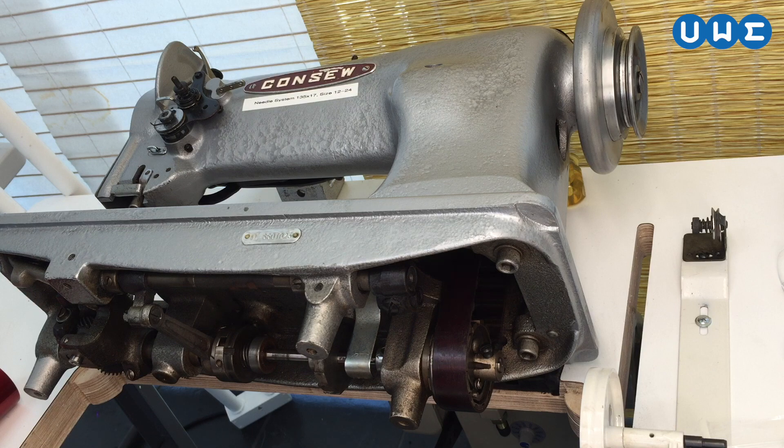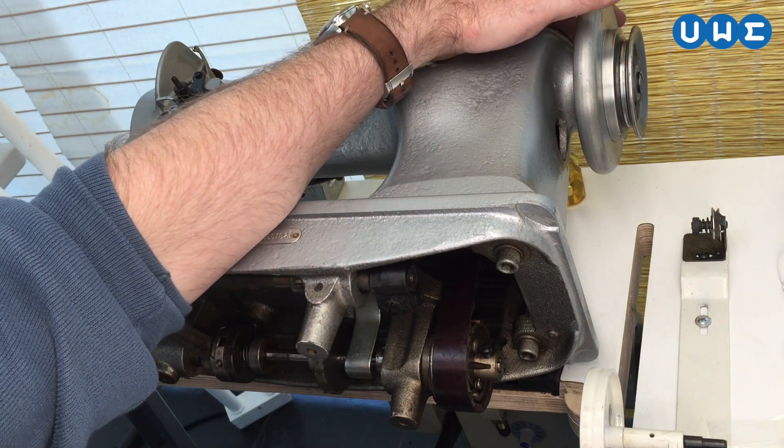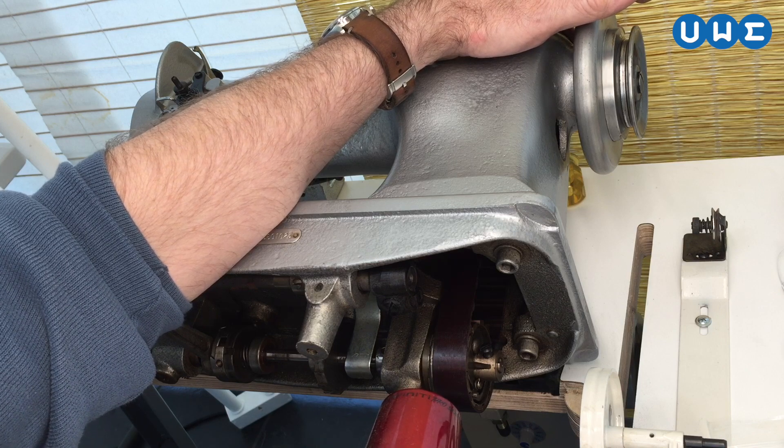In case they're off for some reason, or you need to remove the belt or replace it, let me show you how to take off the belt and put it back on so that things are still properly synchronized. I'm going to use a hairdryer to warm up the belt before I take it off — it softens it and is less likely to harm the belt as you're removing it.